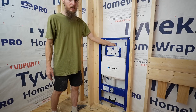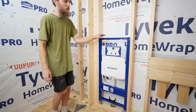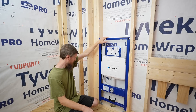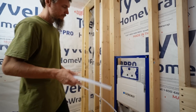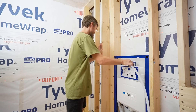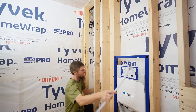I installed a water valve right here at the top and got a hole drilled for the water line. I'm going to start planning out my plumbing — it's got to be done sooner or later. We're installing PEX-A, a cold expansion PEX, which I'll show you later. Basically it expands over the fittings instead of being crimped on. Since we're working on the carrier, this will be the first line I run to the new bathroom.